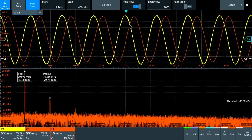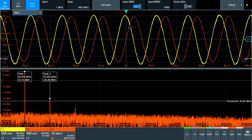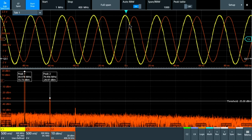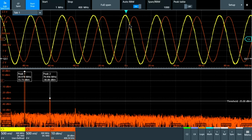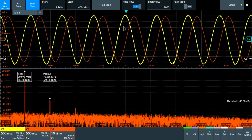And of course we can push the probe the other way by putting a signal that's very large at its input, trying to evaluate what it does to the total harmonic distortion. Now the probe with no attenuation in the front can take plus and minus 2.5 volts. Here I'm putting a 4 volt peak-to-peak signal essentially at the input, which is 80% of its full scale. And we can see both of the signals at the same time in the time domain.